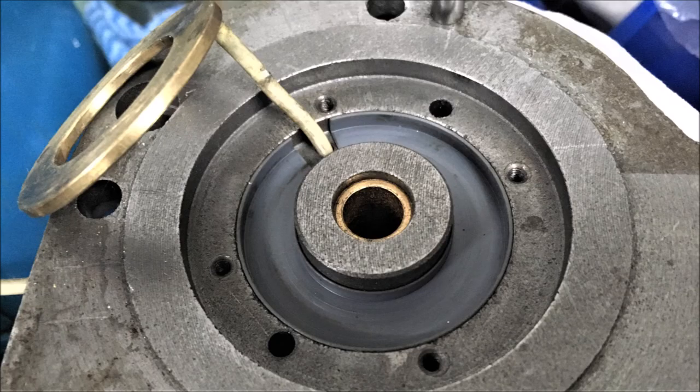If you look closely you can see there is a PVC insulator into which that brass ring is sitting. The one from Hercus, the original one, had just disintegrated, so I made one out of PVC. You can see a white wire there - that white wire is actually let into that brass plate and it just goes out through a hole in the cast iron casting.